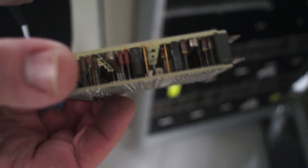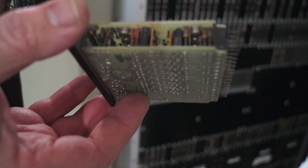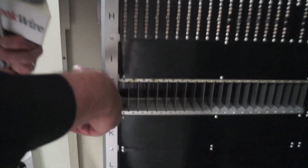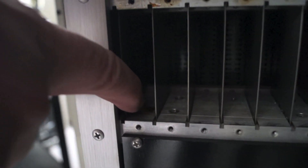This is logic. This is called a cordwood module. You'll notice that there are parts that are soldered on two different opposing printed circuit boards. If you look down in here, there is a copper pipe — the heat transfers from the cordwood module to these plates.